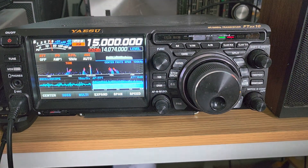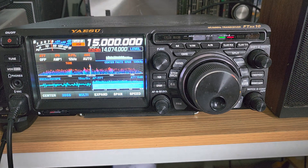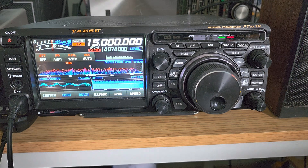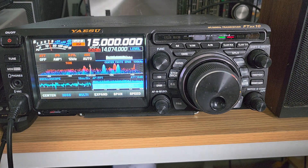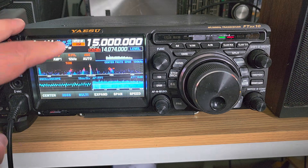Welcome to the shortwave radio channel. I wanted to explain something that I hear often — unfortunately it's the tough part where a lot of people don't understand why they're not getting signals. Their first idea is: 'I'm going to get an amplified antenna, I'm going to get better signals.' The thing is, you won't get more signals, because most of the time amplification only amplifies noise.